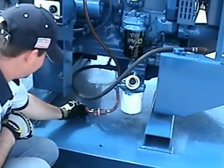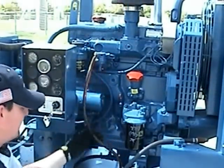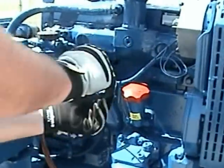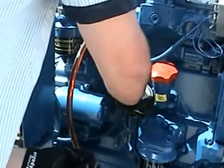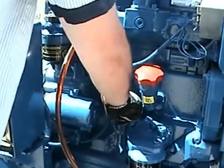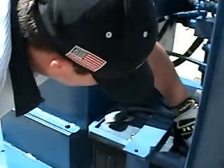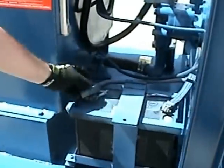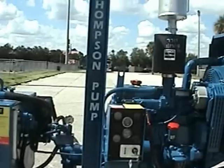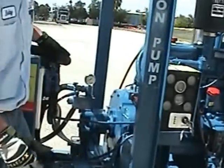Clear fuel lines will allow you to see if you have air bubbles in your fuel. Remember to always check the oil in an engine before you start it. Check battery terminals for tightness and corrosion, and ensure the throttle functions properly — action should be smooth and clean.